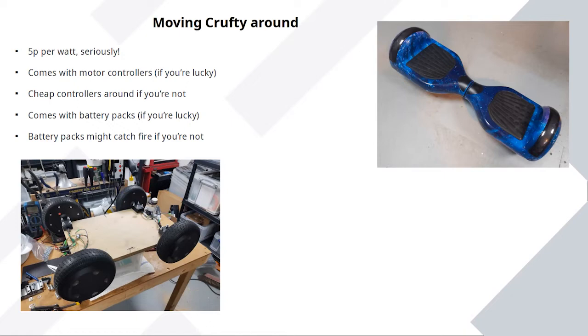The motors you get out of a hoverboard are hub motors, which means there's no gearbox, there's no chains, there's no drives. You just work out some kind of way of clamping the axles to whatever you move around in a suitable spot and apply power. And I've gone with, for now, just to learn about it, the simplest possible chassis, a rectangle of strong plywood, and I've put some 3D printed mounts on for the motors. And you think, oh, they won't be very strong, but with some bolts in them, they're really strong. You can stand on it.